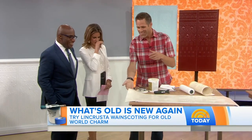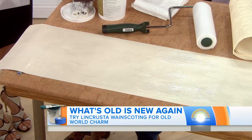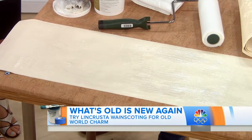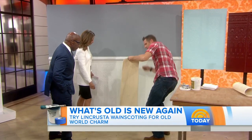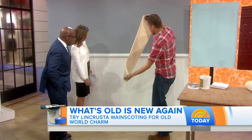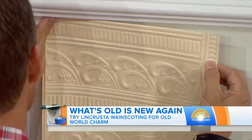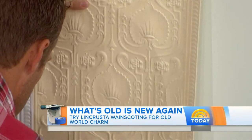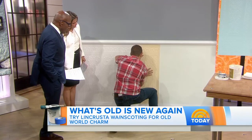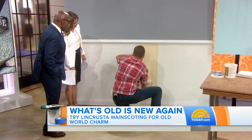It installs just like wallpaper. It already has the adhesive on it. We've soaked it for 20 minutes in water so that it absorbs the adhesive really well. We've already cut it to length. It's as simple as just literally putting it on the wall. Now bring the felt roller over. You want to make sure that your pattern is going the right way. Tuck it into the corner, and once you get everything tucked in, you push. Just like regular wallpaper, you have a little time to scoot it to where you want it, then take the felt roller and roll it right on.